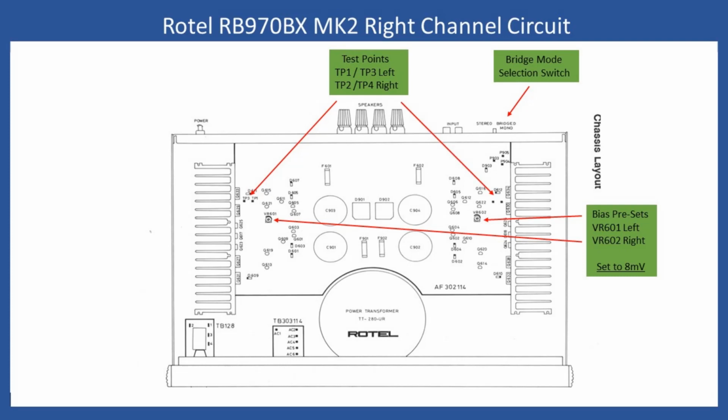But what I always do, and I've said this previously, is power up the amplifier after repair and during an initial test phase with the dim bulb tester, and I'll put the link in the description for the video. Once I'm confident that there is no other issue and there's no excess current, I'll adjust it to a nominal point. Now, this amplifier requires 8 millivolts for each one of the bias settings.